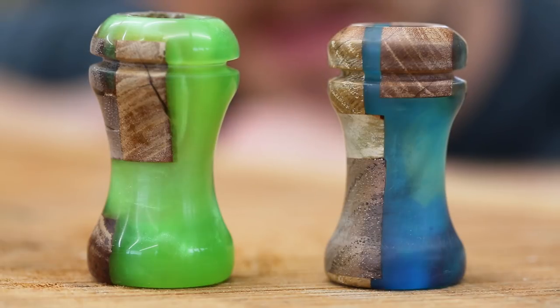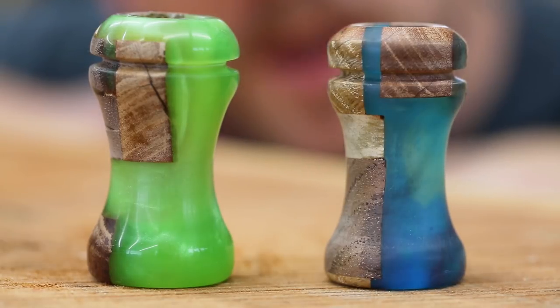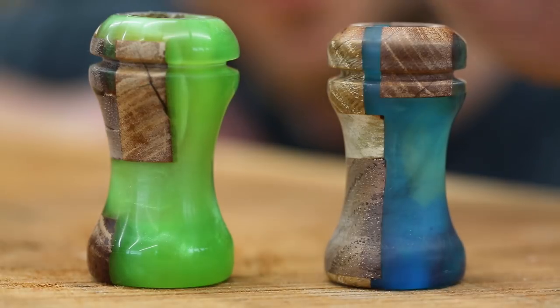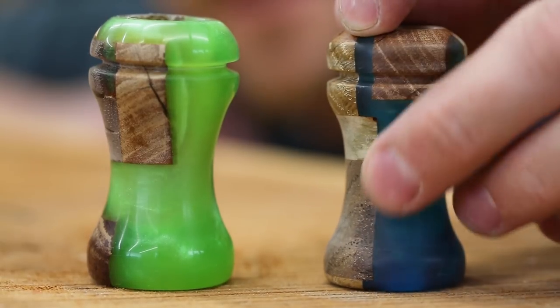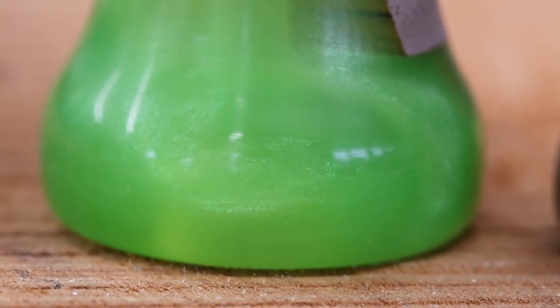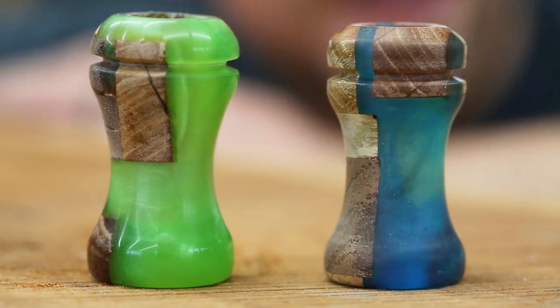I just wanted to give you a quick little sample of how big of a difference that extra polishing makes. Now they both went through the regular sanding process starting at 320 grit up through 1500 grit. The blue one on your right stopped there. The green one on the left went up through 20,000 grit on that foam mesh sanding pad. And you can see a pretty big difference — the green one is a lot shinier and it just looks a little smoother. The blue one, even though it is very very smooth to the touch, just isn't as shiny. It's a little bit duller and you can almost even make out some of those scratches in it. So it takes a lot more work and a lot more time to go through that extra polishing, but the benefits are definitely worth it.